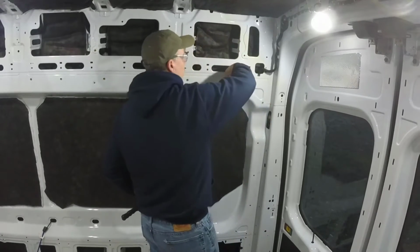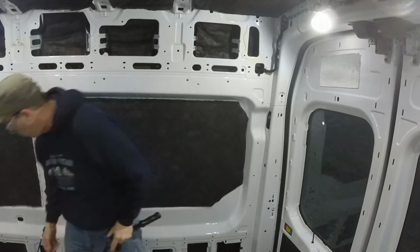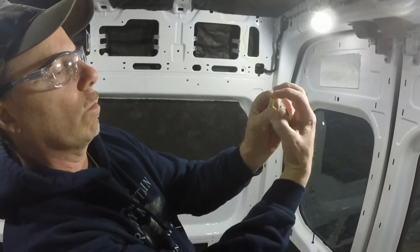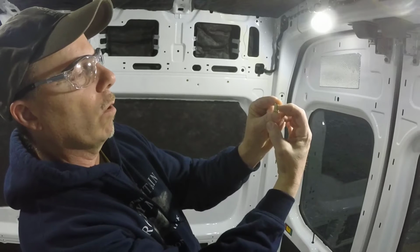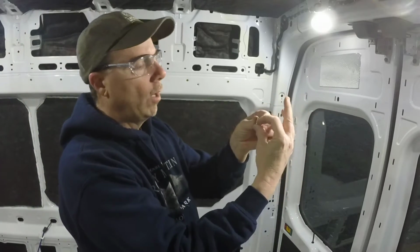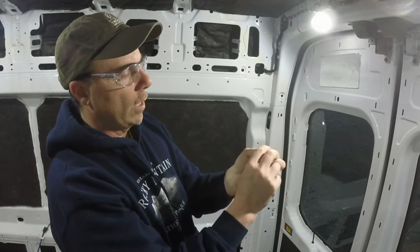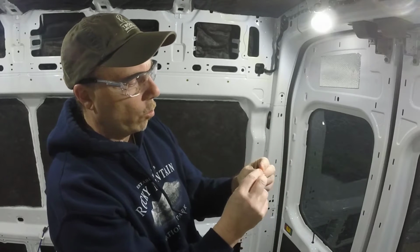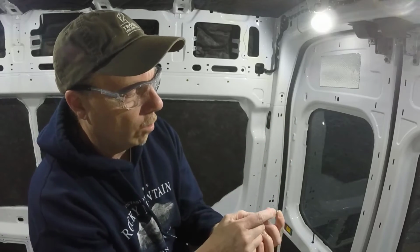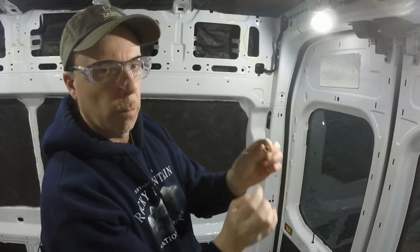And I can't really reach that one. But I can reach back behind these and feel the lip where these have been squeezed down and crimped down. This metal here folds down, and it comes to about 1/3 of the length that it is right now, and then your steel is just behind this lip here. So at that point it's locked in solid, and as long as you have it at the right size, this little knurled edge, hopefully you can see that in the light, there are little grooves in there, that's going to keep this from spinning in the hole, and the tight crimp is going to keep it solid.